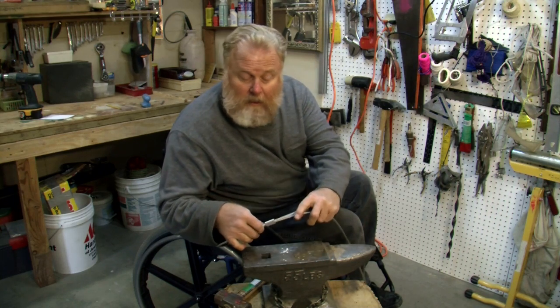Let's talk about the wire ropes I used. It's 3/16 inch wire rope with ferrules and eyelets, and I got the ferrules and eyelets at a local hardware store. To crush the ferrules, I used a small sledgehammer and an anvil I have, but any hard surface will work. Concrete's fine.